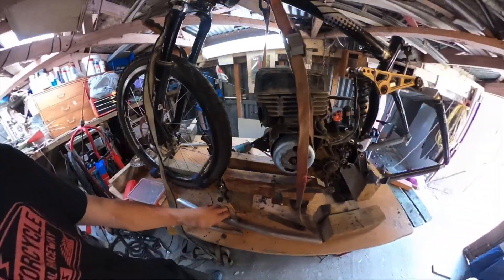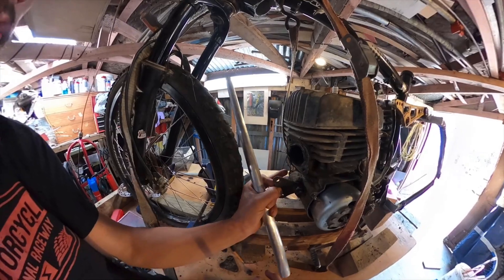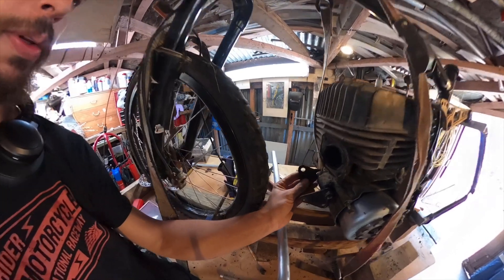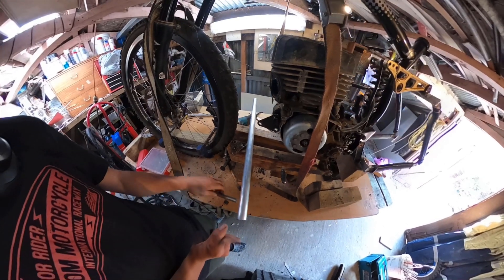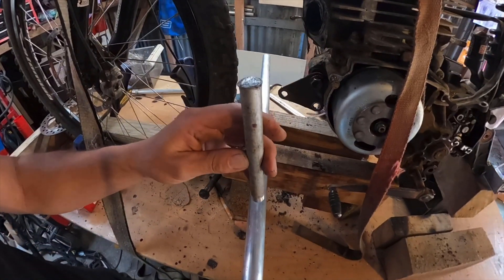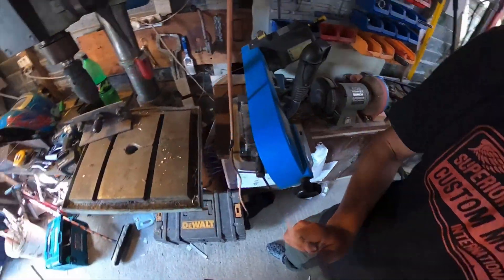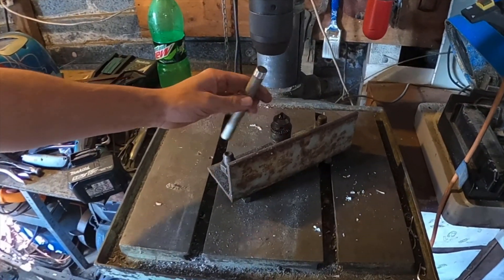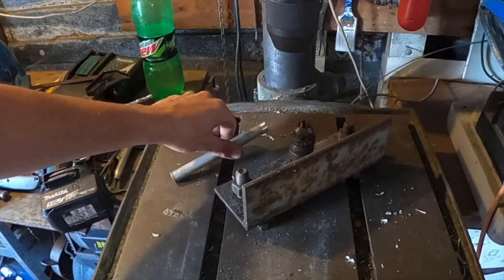The situation I've got now is mounting this — if I just put the bolts through, because there's another plate the same, it's going to crush the pipe. So I need to make a crush pipe that goes through. I found this piece of aluminium solid bar, I think it's 16mm. I can set that through there but I've got to drill a hole in the center. In the past I've made this thing so I can centralize with the drill, put that in the middle and use it like a lathe to drill the center.